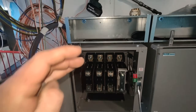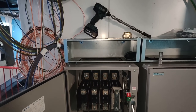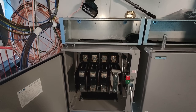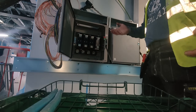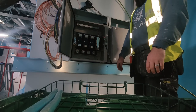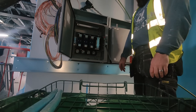What I'm going to do is show you - if you're ever up against one of these monstrosities - I'm going to show you what you can do to make your life a little bit easier. So you've gotten to work and you've realized you're working on one of these Eaton Glasgow switches. Awful things, absolutely awful. You've got a 16 mil bolt - M16. So you've got a huge lug, I've got a four-core 150 to put in there, and I've got less than 300 mil from the trunking to the connection.